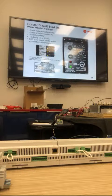So going to the new one, the Time Mark that you see here, it doesn't have the digital display, but it's a lot better. It's going to help. So you're okay with 480 and 2% imbalance? Yes. We'll let you go to 3 if you need it, but we set it here at 2. Even here we have problems with 2% with our factory power. We saw it this weekend. But 3% is what we'll allow you to go to. Anything outside of that, give us a call.